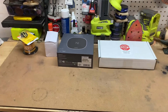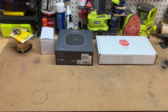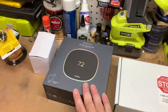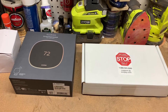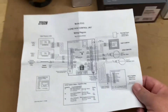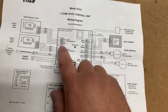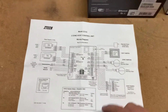If you've got a Butler installed system with the smart vent fresh air damper and you want to upgrade to anything other than the old TS-40B Honeywell — or whatever your house came with — such as an Ecobee, you'll need to go through a couple of steps. The zone control board in the attic is likely a Z-Tech, and whereas your air conditioner requires 24 volts, they've made it proprietary and only push 12 volts to the old thermostat on the wall.